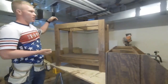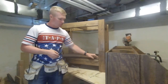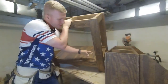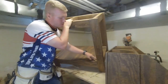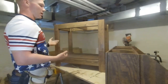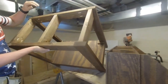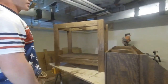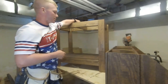This is the base of the coffee bar. I made it out of predominantly pine 2x4s. I used some 3/4-inch plywood on the edges here as well, because as I was making cuts for the baseboard I went a little too far with my table saw, which made it unsightly. So I made a decorative cut-out square around that to cover up those flaws and make it look nice and flush. I used Kreg pocket holes to do most of the joinery. I have three cross beams up top holding it together. It shouldn't have too much lateral weight since it will be pushed up against the wall, so I didn't think diagonal bracing was necessary. It's very sturdy and level as is.